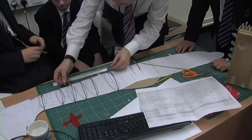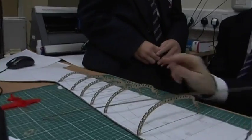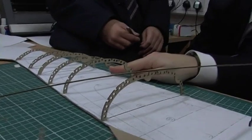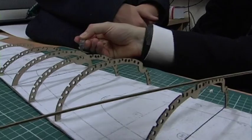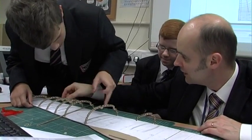Also, I don't know who did frame 16, but see those corners there? They're very sharp. What that will do is focus all your stress at that point, and the frame will be likely to snap. So what we need to try and do is smooth everything off so everything's a smooth curve.